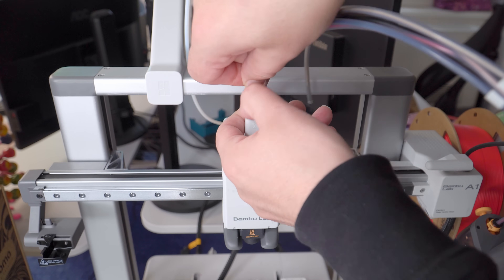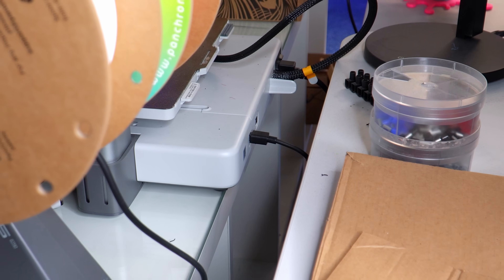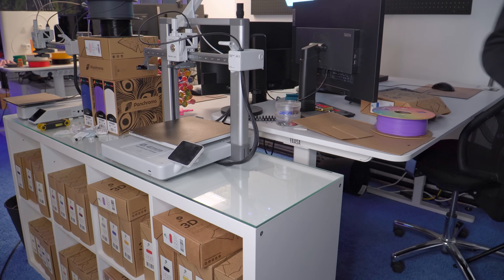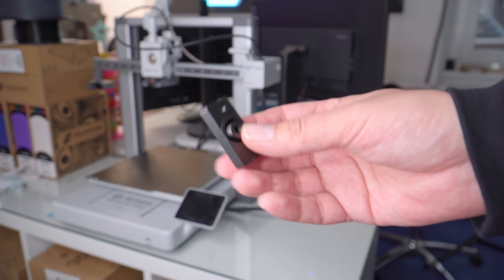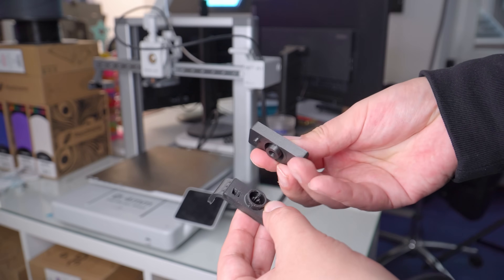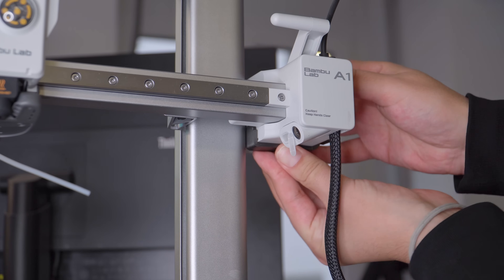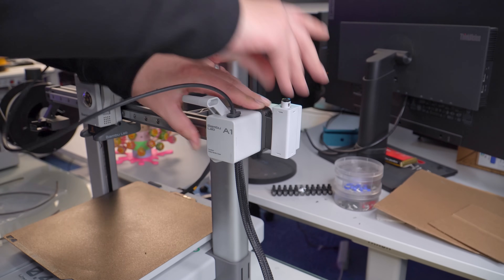First, remove the PTFE tubes, and maybe unload one of the filaments if you need to. Then remove the clip, but don't discard it — you'll need it later. Hot swapping these cables is probably not a good idea, so make sure the printer is off before removing those, and then you can get rid of that light. Now get the new clip that you printed and insert the knob into the L-shaped bracket. There is a protrusion on the slide connector that fits into the hole on the bracket. Push the slide connector into the hole with the knob so it snaps into place, then snap fit it to the right side gantry mount. It should just click into place just behind the gantry. You can now slide in the new hub with the cable ports facing the rear.